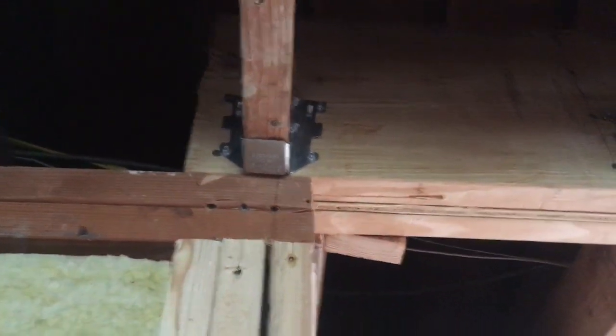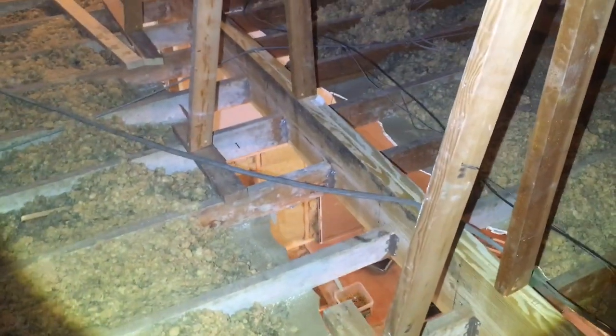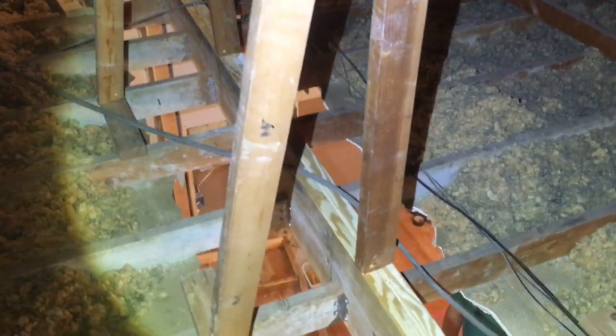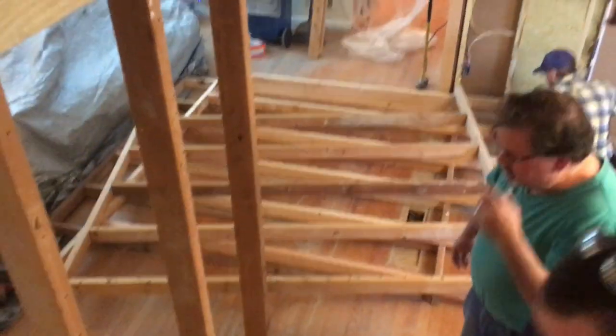The header is being held up by 2x4 cleats. The brackets are holding up the 2x6s, and that is holding up the drywall and plaster. Here's that cleat — three of those holding up the weight of one end of the header. Here's what it looks like finished up in the attic after all of those brackets are in place. You can see a couple of these 2x4s are like extra brace support for the roof. We pulled back the plaster and the drywall so we had access to put the brackets up there, and then we're just going to hang drywall back over all of that. That header is now strong and secure. We can remove our temporary walls, start to hang drywall, and now we have one big continuous room.